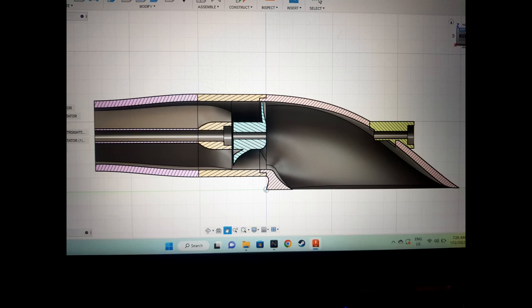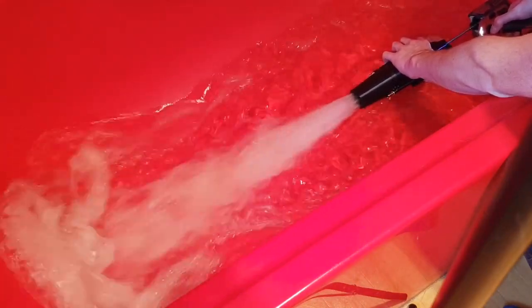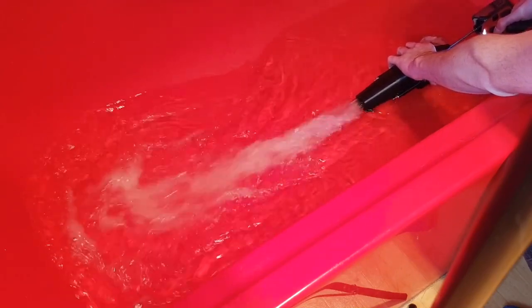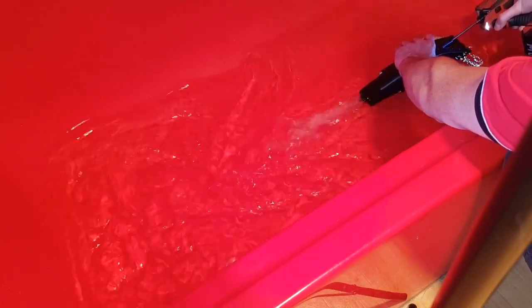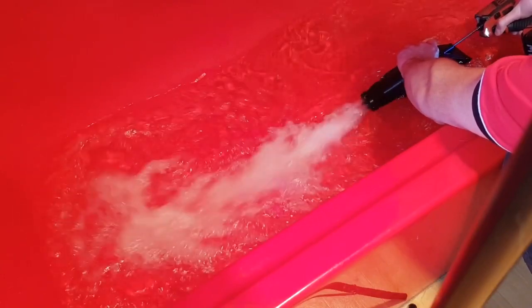The pump is pumping. Now to get it thrusting, we need to restrict the outlet with the nozzle, creating high velocity. With the nozzle, I've restricted the diameter by about 30%. The extra load that's put on the motor is cutting out and confusing the electronics of the drill. I need more power. Whenever I was going over about 70% throttle, it would cut out.